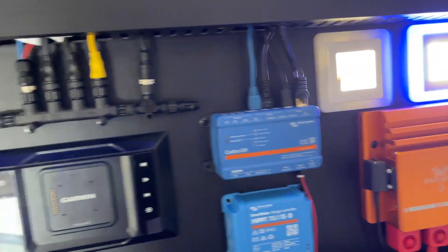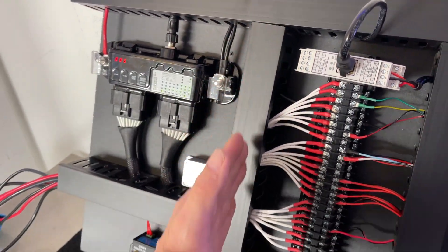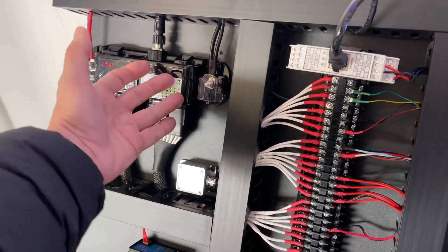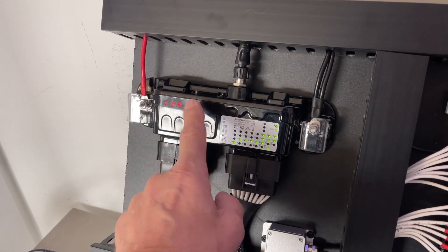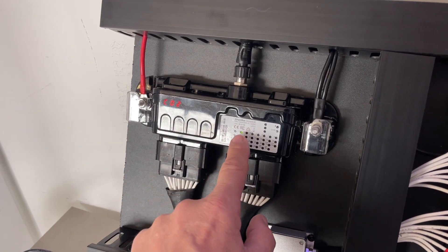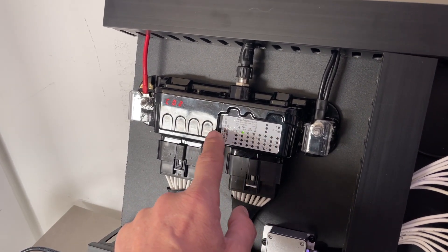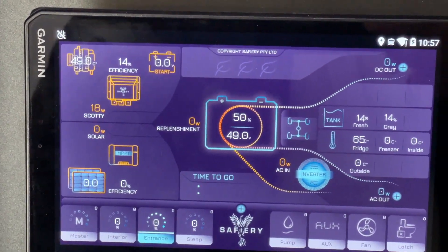That's the complete walkthrough running on the system. In the Unimog, the digital switching goes at right angles out of here — it's 250mm deep going into a cavity, with the digital switching coming out at right angles. If for some reason the main display goes down and you've ordered this backup bulletproof connector with the little LEDs, you can manually select the channel and turn outputs on and off from this backup display. You can see I've selected channel 2 there and can manually turn it on and off. I think that's pretty good — how good's that?